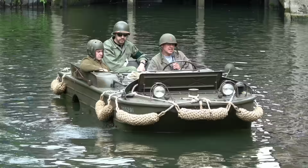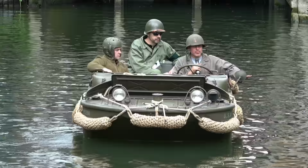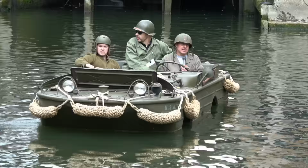I mentioned they have a mechanical bilge pump. That comes out by the hole just to my left, just where my hand is. There's a hole here. That's where the mechanical bilge pump comes out. We also put in two electric pumps as well, because if your engine was to stop for any reason while you're on the water, then you would not have a way of pumping yourself out. So with some electric bilge pumps in, it just gives you that little bit of extra safety.